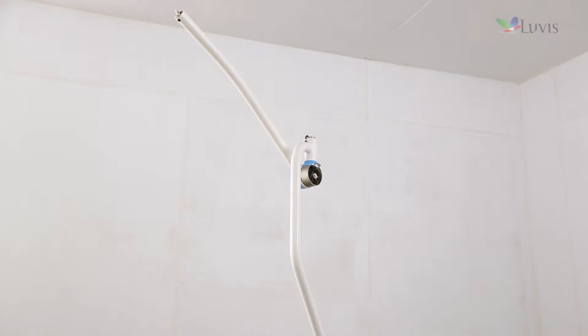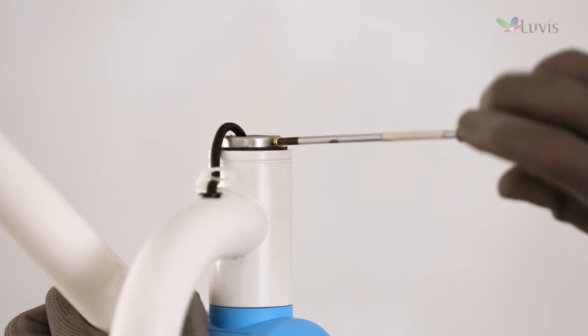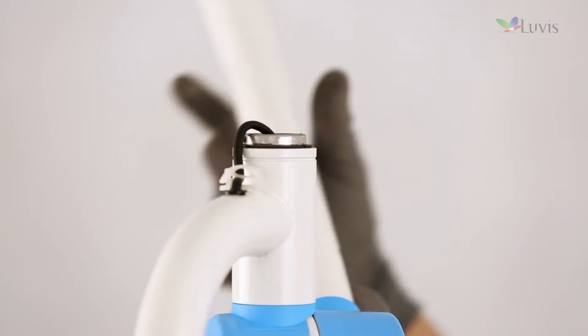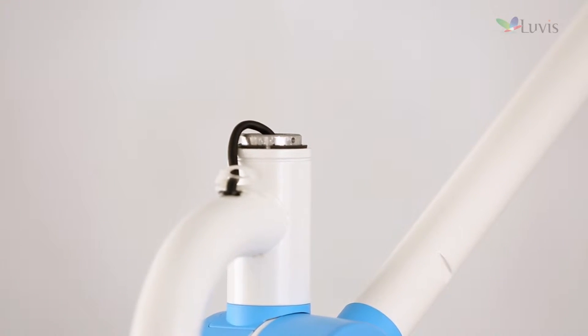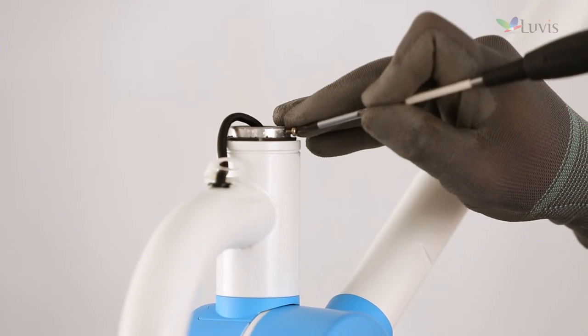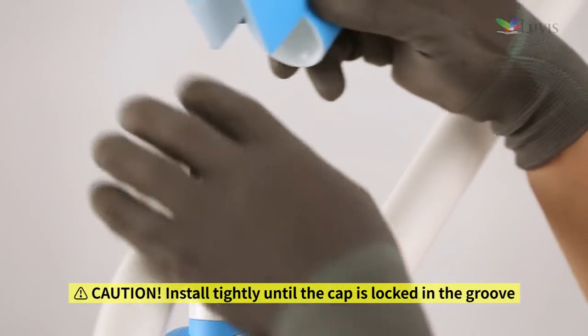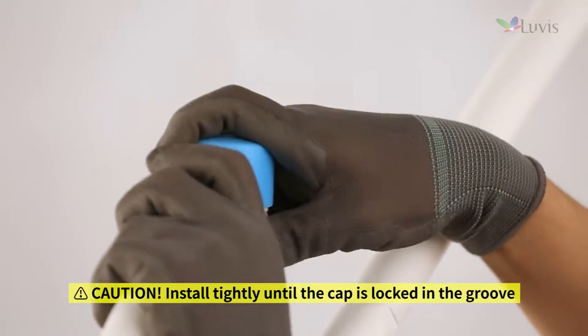After fixing the FE wire, put a joint cover over the first horizontal arm. There are screw docking holes on each side of the upper part of the first horizontal arm — tighten the M3 screw into the docking holes on both sides. Install the vertical arm joint cap.